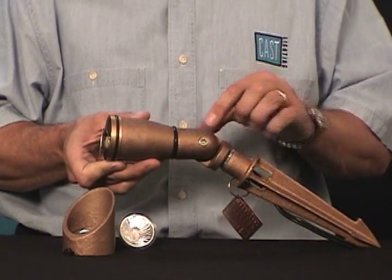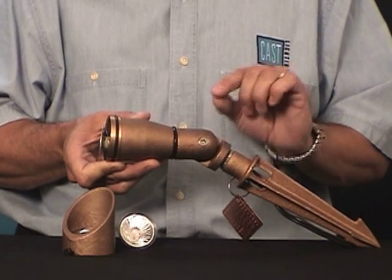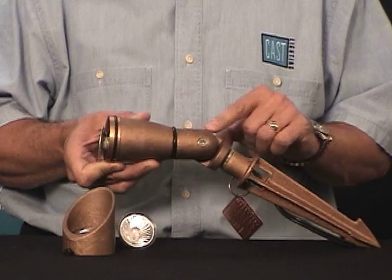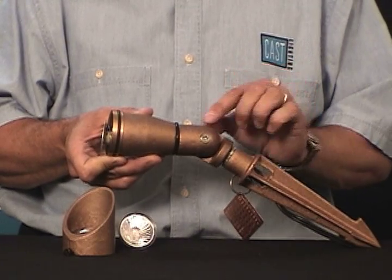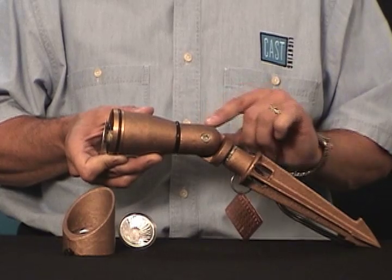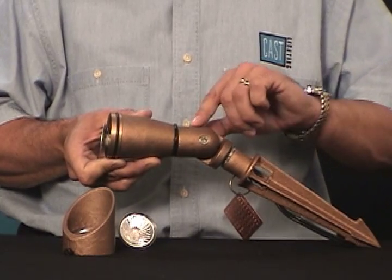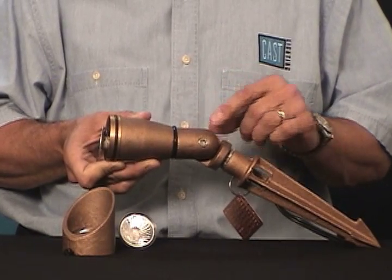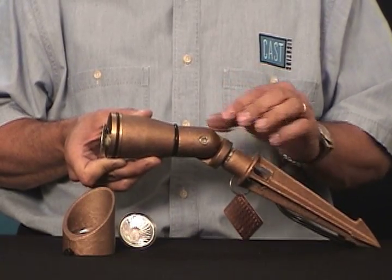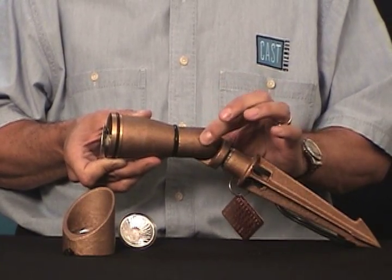We put the splice in the knuckle because it's much cooler, number one, and in addition to that, we use a manual crimp connector, and we solder each one of the connections to give us a beautiful connection, and then we also use a heat shrink material that insulates the connection from the outside world using a high temperature heat shrink with an internal sealant. So it gives you just a fantastic connection inside the knuckle.